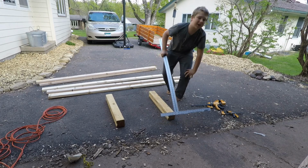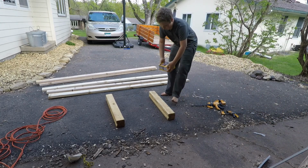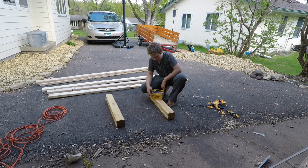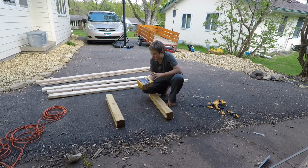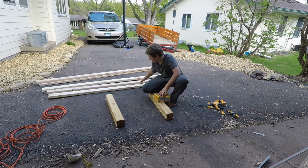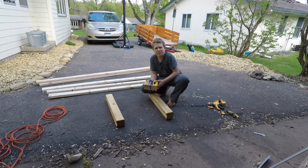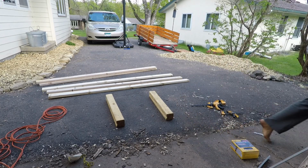We've got a box of screws. I'm not sponsored by any of these companies, but we like to use Deckmate. Really nice screws. These are 1.5 inch, 5 pounds. These are going to help us connect our 2x4s together securely. They use a star bit, but I do believe it comes with one in this box. I did pick up some other hardware, and I will show that to you here.